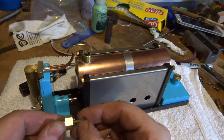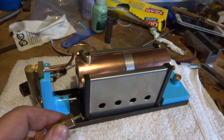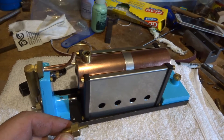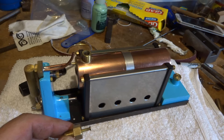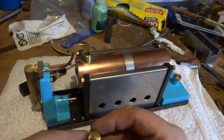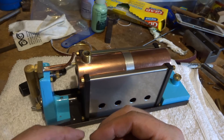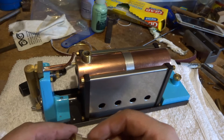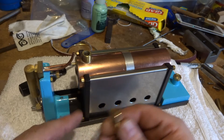The issue I have with it is that if we take it apart, this screw thread is the only place that the steam has to get out. As steam escapes it expands, and there's nowhere at all for the steam to expand there. I don't like that much at all, so I'm really not even going to try the engine with that in it. It's probably going to be a bit dribbly and a bit scary.